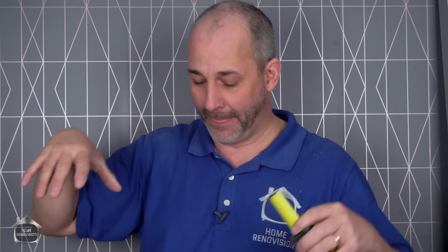So we're going to just put together a couple units real quick, and then we're going to install all of our crown. So we're going to show you how to make the assembly. If you have a nice flat surface, you can assemble these really quick with an air nailer and a finish square. We're going to show you that trick so you can get that done. And then as far as the crown molding is concerned, we're using kind of like a styrofoam crown molding with a plaster face on it. It's an awesome product. We're going to put a link in the description below so that you can take a look at that source online.